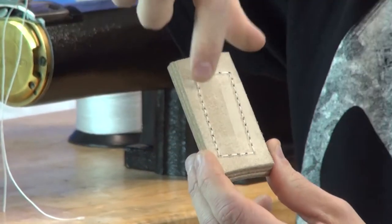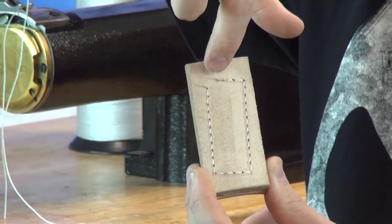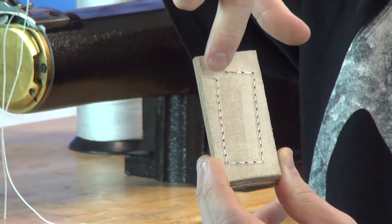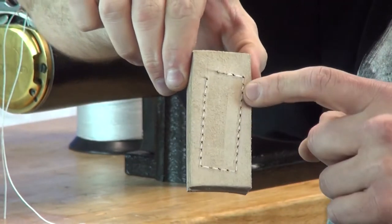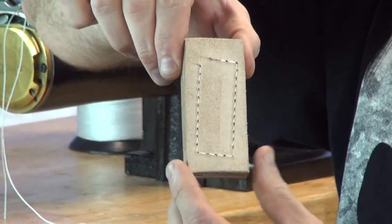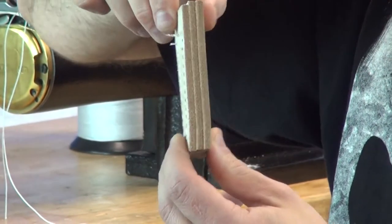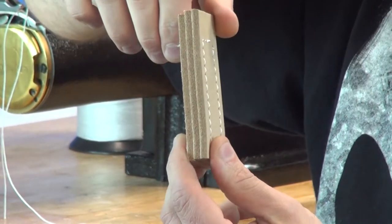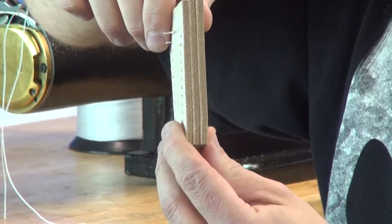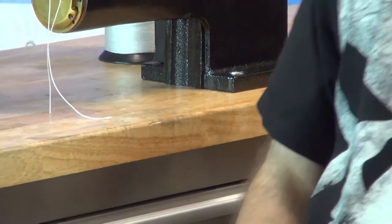Now I'll show the back of the material. This is where we started and this is where we cut the last stitch off, so if you see a little bit of scraggly thread hanging there, that's because of that. But focus on this area right here — you can see that the stitching looks extremely nice, it's extremely compact, and it's pulled the knots up into the bottom side of the material extremely well. Again, this is approximately three layers of 8 to 10 ounce skirting leather or tooling leather, so the machine is quite capable of sewing heavy leathers with ease.